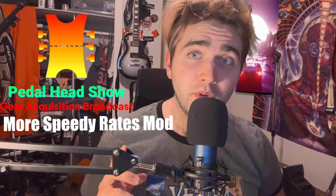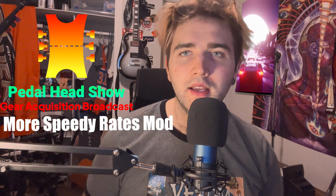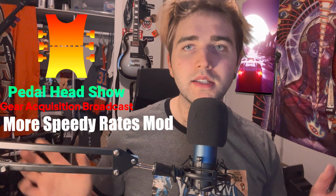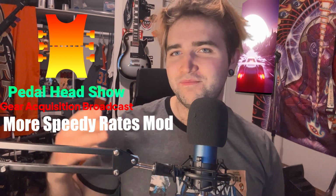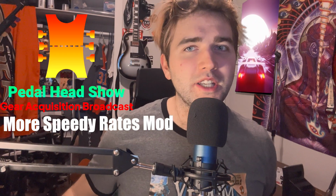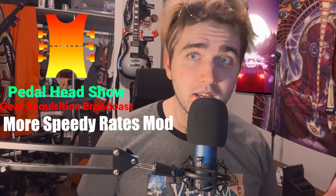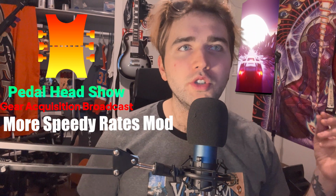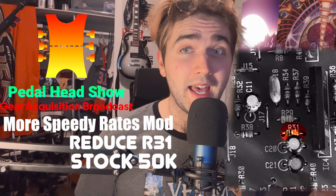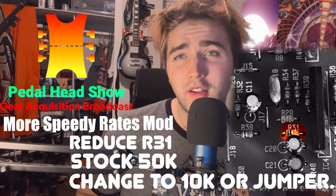So the next mod we're going to be looking at is experimenting with the Boss TR2's rate. I've always been pleased with how slow or fast the Boss TR2 can get. I haven't really thought that I needed to increase the depth or rate of this pedal yet. But I thought for the experiment and the Wampler mods, I might as well show you guys. You can increase the rate of the Boss TR2 by reducing R31 from 50K to as low as 10K, or you can even jumper it for some really insane FM quality sounds.